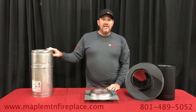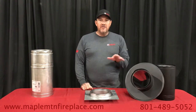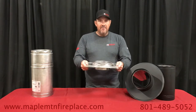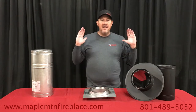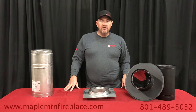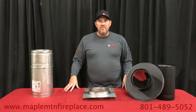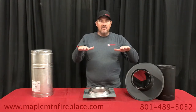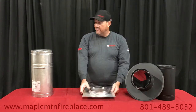When I was a kid we were up in the mountains and there were some earthquakes and a lot of chimneys fell over. This was our solution: we would adapt an anchor plate to it and then run a metal pipe and frame around it with 2x4s. It was a great solution for an old chimney that has fallen over or is crumbling — you take it down to the base that's actually a solid chimney and then you can adapt to it.